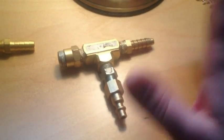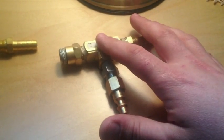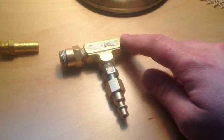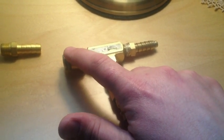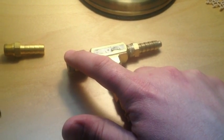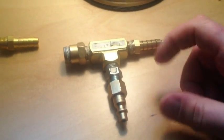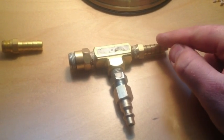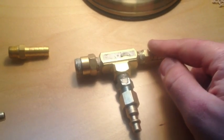Sharing this information with all of you. First off, this is a brass tee fitting with all female connectors. I've got a hose barb, a male connector, a quarter inch, as well as a quarter inch here with a male and a 3/8 female adapter with a 3/8 plug that I've drilled a hole in. How this works is basically I use compressed air and fuel — or whatever it is — compressed here with a fuel pump, and it sprays out a beautiful mist.